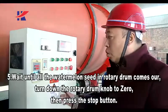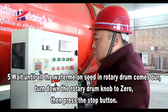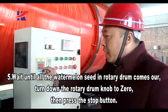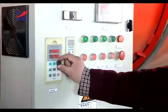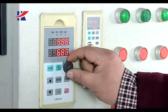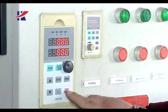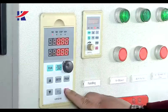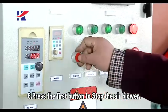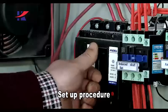Five — wait until all the watermelon seeds in the rotary drum come out. Turn down the rotary drum knob to zero, then press the stop button. Six — press the first button to stop the air blower. Seven — turn off the power supply.